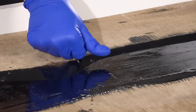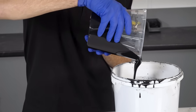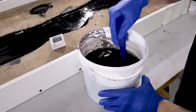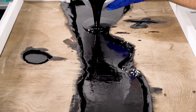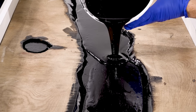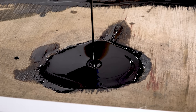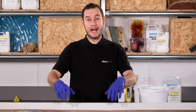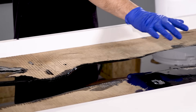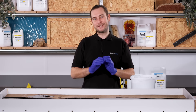The bonding and sealing resin has now reached the B stage, so we can move on and do our final pour where we completely encapsulate the plywood core. If we got our sums right at the start, this pour should use all the remaining pigmented resin. Following the same mixing procedures as throughout, it's now just a case of pouring the resin gently into the gap around the sides of the core and then continuing to pour all the way up to the top so it's fully encapsulated. The resin should fill all the way up to the top of the visible planks. Due to a bit of twist in my planks some areas don't quite reach the top, but we are going to be machining this flat anyway. That's our final layer of resin — the core is completely encapsulated. Leave this to fully cure; with GlassCast 50 at 20°C that's about 48 hours.